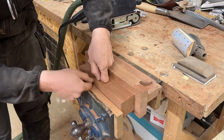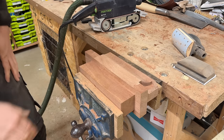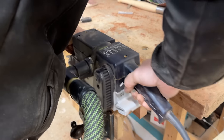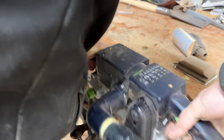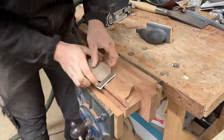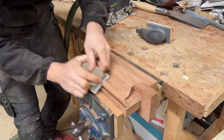If you see the paint, like the ripples from the rebate where it's cut through the paint finish, it looks terrible. So you've got to sand all that out. Time consuming. Using 150 grit paper, and that should be enough then to paint straight on top of.